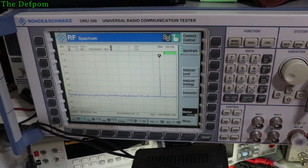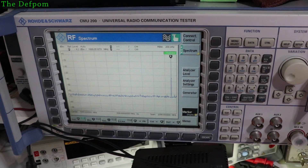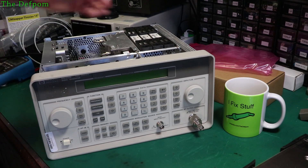That's good — it didn't give any errors. Let's do actual 2 GHz as well, right to the very top. 2 GHz: minus 4.2 dBm. I'm pretty sure it won't go any higher if I try to force it — and no, that's it. It works. Excellent. So that was a pretty good win — I now have a spare board for this thing.